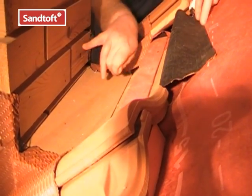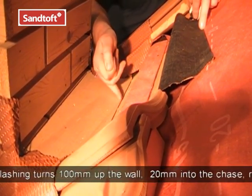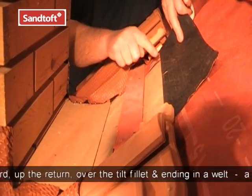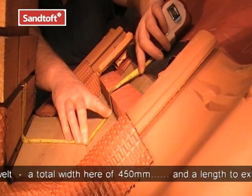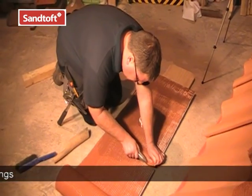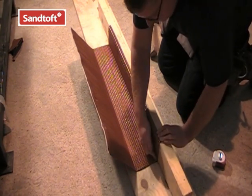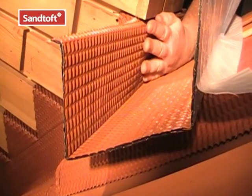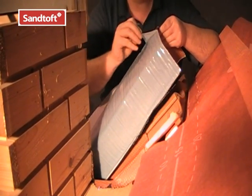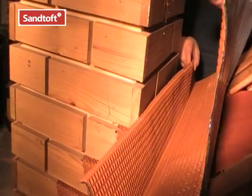Next we are ready to form the back gutter flashing. The flashing will start with an upstand at the back of the chimney, run across the back board, up the return, over the tilt fillet to the top of the board and then finish with the welt. Here we need a total width of 450mm and it must be long enough to reach the outer edges of the side flashings. Once the Coraflex is cut to length, we can make the appropriate bends for the turning, the upstand and the return. Then we can put the flashing into place to check for fit. If everything is ok, we can remove the first width of backing paper from the upstand and base and then place the flashing into its correct position.